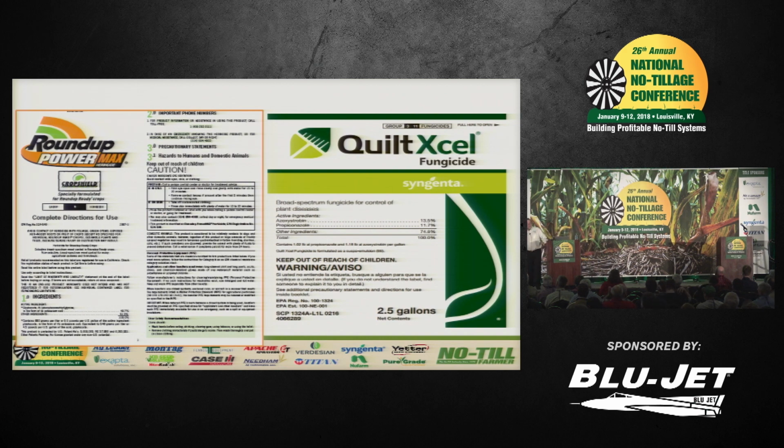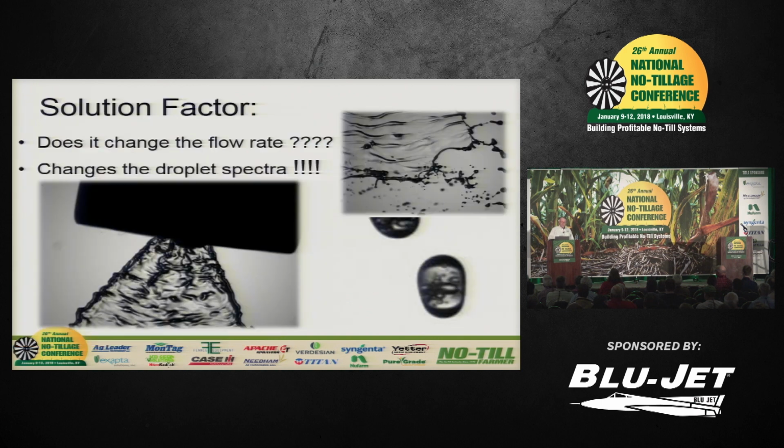So if you set the sprayer up to not drift the Roundup, you're not going to get coverage with the fungicide. And if you set the sprayer up to get coverage with the fungicide, what are you setting the Roundup to do? Drift. So that's not a good practice either, even though it's very common because it saves us a trip over the field.